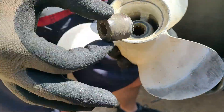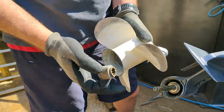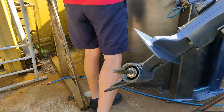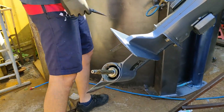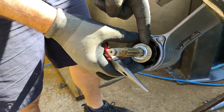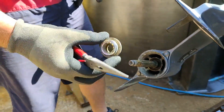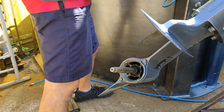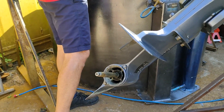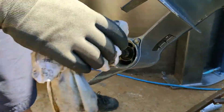The 25 has a special spacer — make sure you pull it out and use it with the next propeller. Sometimes it gets stuck in there so make sure you pull it out. In the back we have the thrust washer, which again we need to pull out — this sometimes gets stuck in the old propeller.